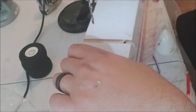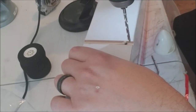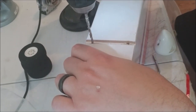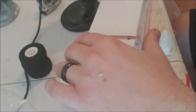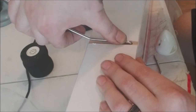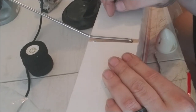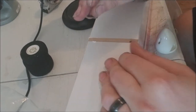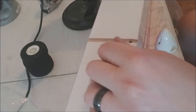It's okay for that hole to go all the way through. See some of that epoxy we pulled up — that's from where we coated the inside. So now I'm going to poke it back down in there and wiggle the drill a little bit. That way we get a good fit. Now see right here — that radius is keeping our wire from laying in the bottom of that trough. That's the problem I was talking about. So we're going to lay those holes over, and I'll show you exactly what I mean. I'll check the size of the other one — that's good, awesome. So we're just going to lay those holes over to compensate for that radius.